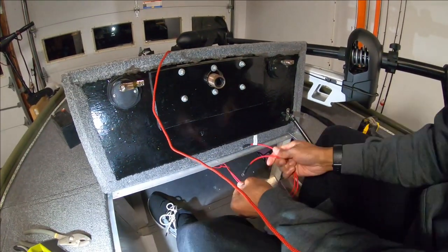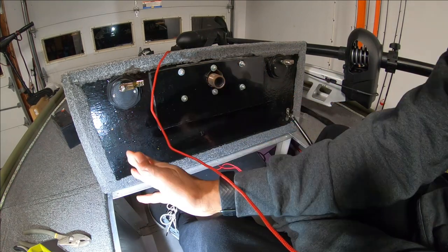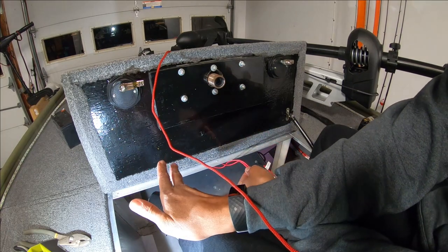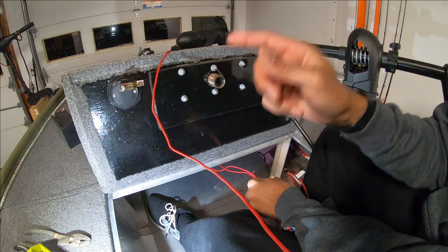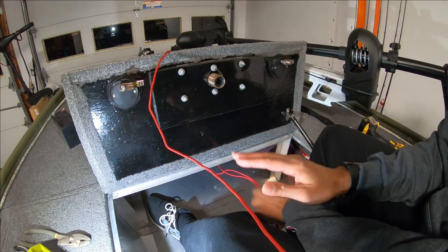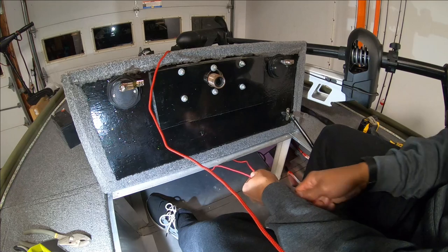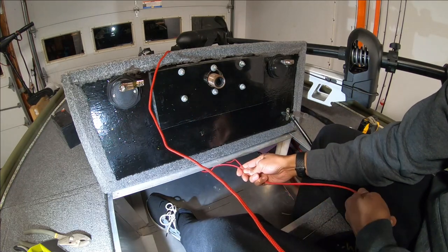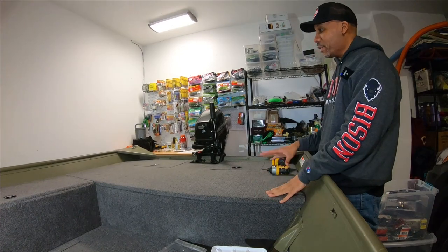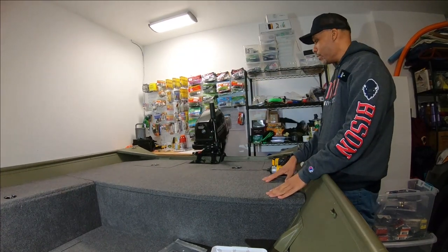I actually made a mistake in my thinking. Originally I was going to connect the two power leads from the front left and right deck lights to the positive bus bar underneath the deck, but that doesn't work. I would not be able to turn on the deck LED lights by themselves on their own independent switch — I already have a switch connected to the power bus and having two switches going to the same bus is a bad idea. So I'm going to do what I did for the front nav lights: splice it and connect the two leads together to one wire that will go to the switch. Best case scenario is to remove the rear deck so it's easier to get the wiring from the rear to the front where the switch panel is.